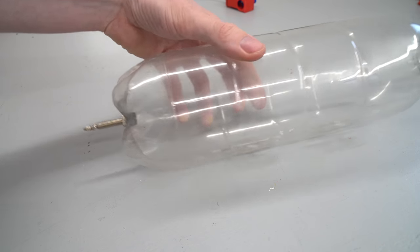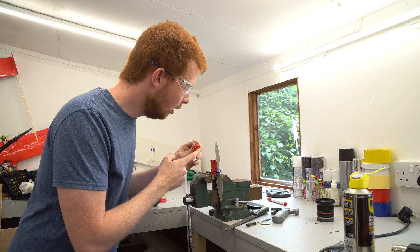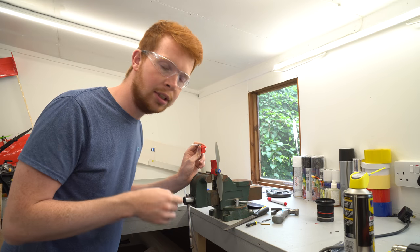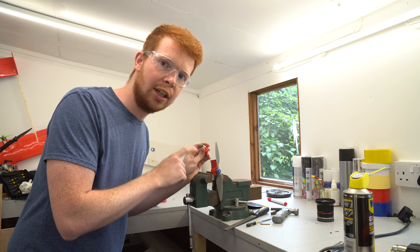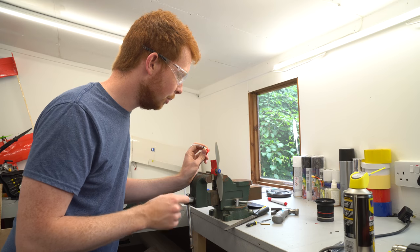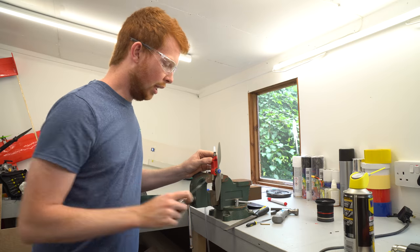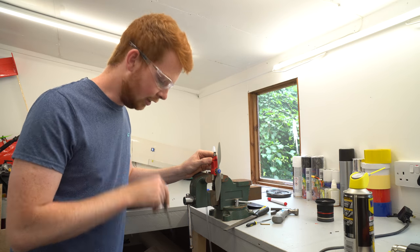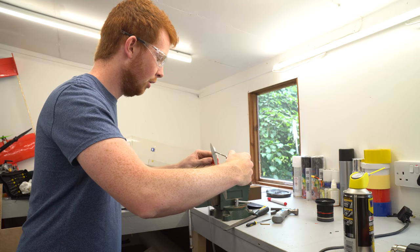Now it's time to get the engine running. So the reason why you don't want to clamp the cylinder head down too hard on the first attempt is that you need to make sure that the pushrod bolt is just the right length for the engine to run. So I'm just going to give you a quick example of what happens if the pushrod isn't long enough. So I have the air supply in the bottle, which is hanging down below the desk. That's all pressurized, so if I spin it up,